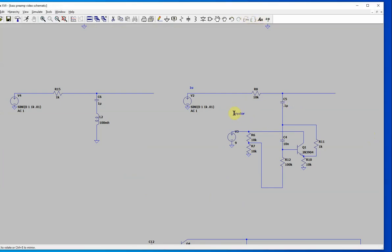So this whole thing here. Now here's the resistor, here's the capacitor, and this whole conglomeration is a simulated inductor. They call that a gyrator, and the formula for the inductance is you take this resistor, multiply it by this capacitor, and then multiply it by this resistor. And if you do that, you end up getting one. So this is a 1 Henry inductor.